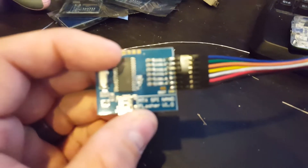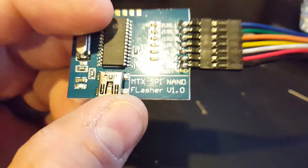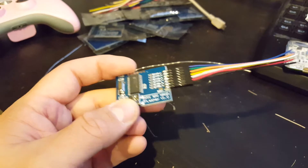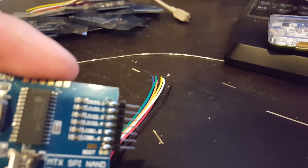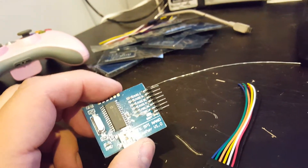Here's a quick sneak peek on another little enhancement coming to my web store soon. This is the Matrix SPI NAND flasher. This is a really basic little NAND flasher that's capable of reading and writing to 16-megabyte NAND consoles, which is everything except for the Corona 4-gig. It'll also read the 256 and 512 megabyte NANDs as well. What I've done here is taken that same pin-header idea — on this pin header I have extended and soldered on seven of those, the same thing that was on the NANDX, because it takes seven wires to read and write to the NAND.